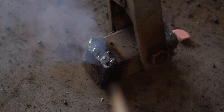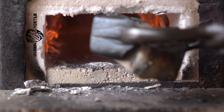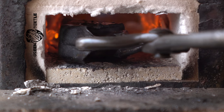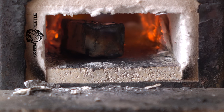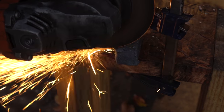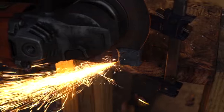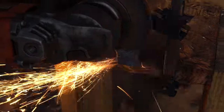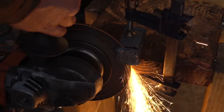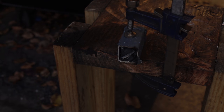Not a lot of good instruction on making blister steel, which is sort of what I want to make. Depending on what you're using — oven or forge — people say a couple hours at 2100°F, or four hours at 1800°F. In the old days in Sheffield they'd leave it in there for four or five days at 1500°F in a little crucible to get blistery steel. I'm hoping we've done something like that — this stayed in the forge at probably close to 1800–1900°F for about 50 minutes.